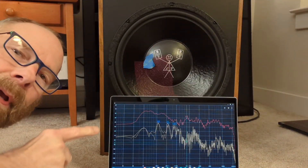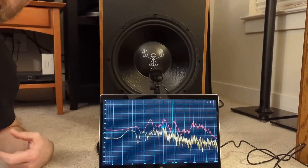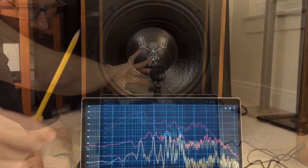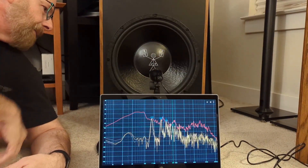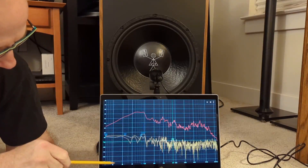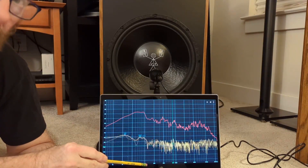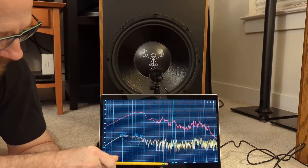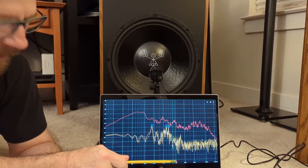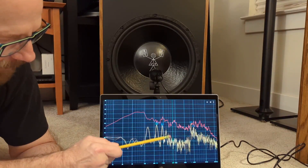Let's see where we're at with this frequency band and show how it reacts as we're hearing music play over that woofer. Before the frequency test, I'll explain the setup: it's a unidirectional mic centered pretty close to the woofer. The frequency increments are 10Hz, 20Hz, 40Hz, 100Hz, 200Hz, 400Hz. And I've got the crossover — this green line — set at 809Hz, as close to 800 as I could make it. That's the crossover point from woofer to tweeter.